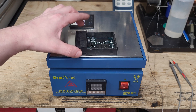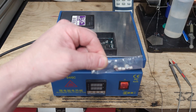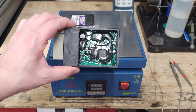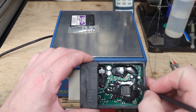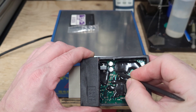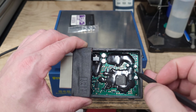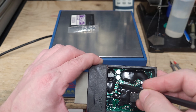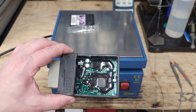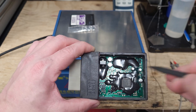I'm back — got this Mitsubishi transmission controller board done. Here are the old capacitors. We meticulously and painfully chipped away at the epoxy because the solder pads were pretty much covered. It's very difficult and takes a lot of time. I understand now why they charge three to four hundred dollars for these repaired.